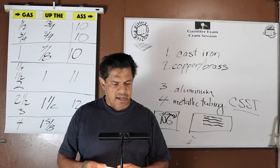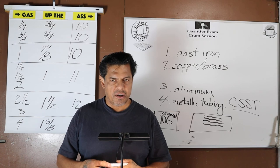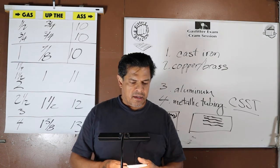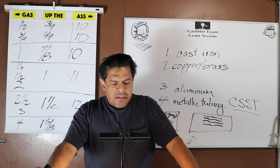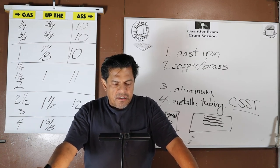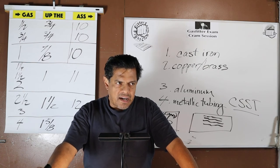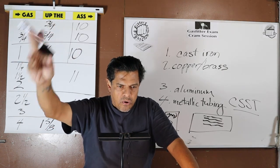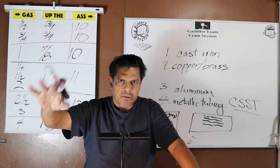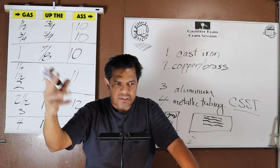Where in contact with corrosive material or atmosphere, metallic piping shall be coated. So corrosive material, atmosphere: someplace humid, cinder fill, cement pours, stuff like that. It's in contact with cement, or could come in contact with water around the cement, and of course that frees up the lime and that stuff starts eating away the pipe.